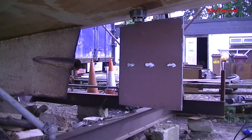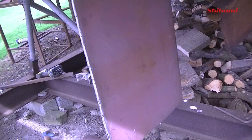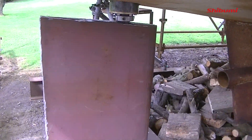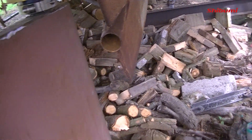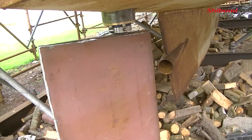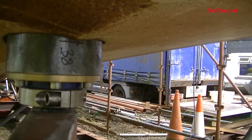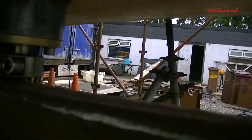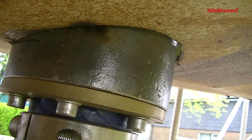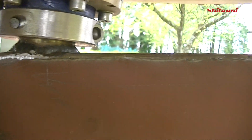This is Shibumi's rudder. It is impossible to move around here, but there it is — it moves completely freely and it is rock solid. I will weld all up in there when it is less windy, it is blowing again here currently. You can see our little measurement there — 38 millimetres on one side. And on the inside, the line — which is the important one, the one we kept — that line there is 24 millimetres. That gave us our exact height upstairs to get it under the floor. So that is the locking collar to stop it jumping up further.